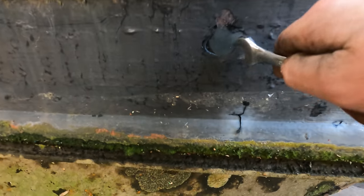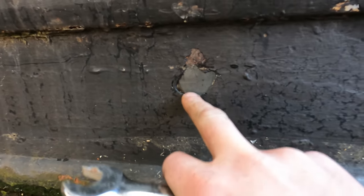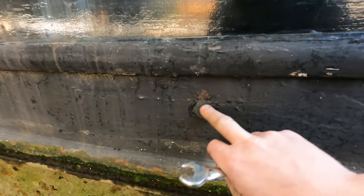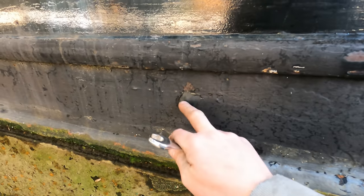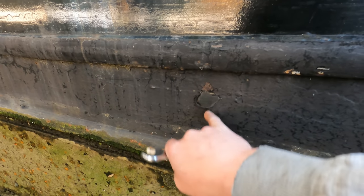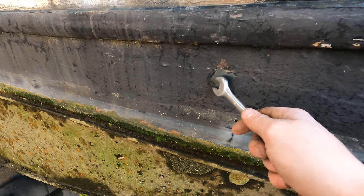Oh, we've got air up. See here, see this mill scale, this dark grey stuff, that's what I'm expecting not to come off. That's already on the steel. When steel's rolled or pressed when it's made into its sheets, it gets this thin layer of what they call mill scale. If it needed to come off anyway, why is it still on when I get to it? So we're not bothered about taking that off, we're just going to key it up for paint. I'm going to leave that mill scale that's underneath.